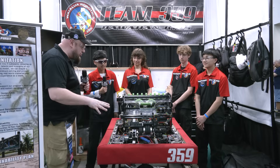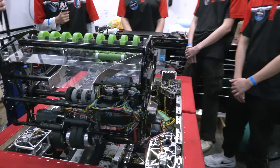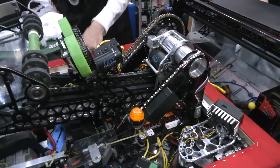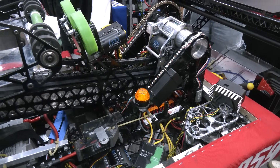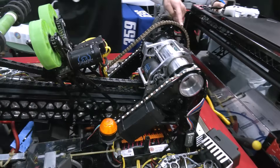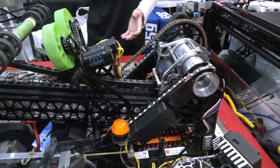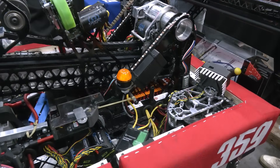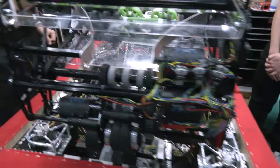Let's start to break down this robot here. We're going to go through the arm and the pivot system first. So we have four motors powering our pivot on a 111-to-1 gear ratio, and then we have a chain that connects to this dead axle shaft that holds the whole arm up. We're able to get the four motors just to get enough power and also enough torque to climb.